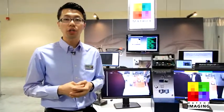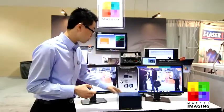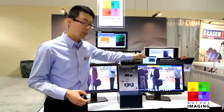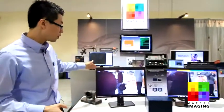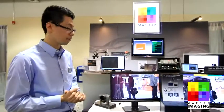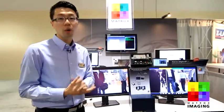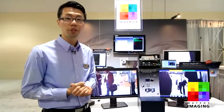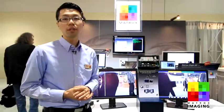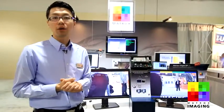Of course, if the resolution is smaller, you're able to offload in real-time more video streams at the same time. On this demo, what we've shown here is doing a single 1080p60 capture and encoding. On the right-hand side you have the live video, and on the left-hand side you have the compressed video stream, just to show users and compare the quality between the live and the playback. As you can see, this integrated platform fitted with the Orion HD running our Matrox Imaging Library is an ideal solution for image capture, processing, encoding, and display needs of medical imaging applications.